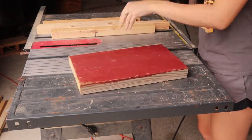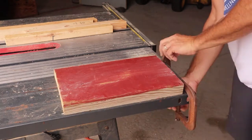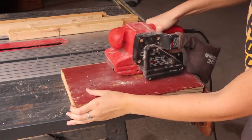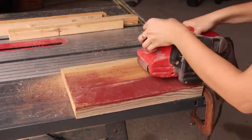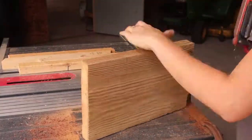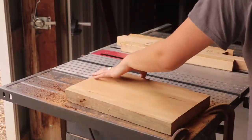The little sander was quite powerful, so my dad put a couple of clamps on the table to make sure it wasn't going to slide around. I took all the paint off of that one side of our wood, then sanded everything else down. I used 150 grit to make sure it was nice and smooth. Even though this is a vintage stool, I did want the sides to be nice and smooth so that if you pick it up or bump into it, it's not going to hurt your fingers.